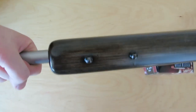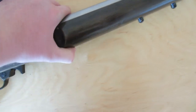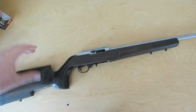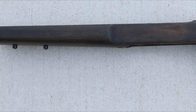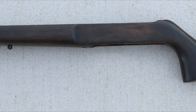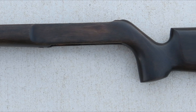Another basic concept in finishing is that you want to start with lighter colors and then work darker. Since I started dark, I was kind of stuck with what I had, because it's really hard to go from dark to light — you're basically out of luck if you want to change it. As far as sanding, I only did minimal sanding before I started, and then when I wanted to take the stain off, I ended up doing a lot more sanding afterwards.